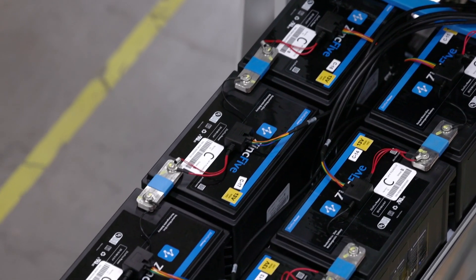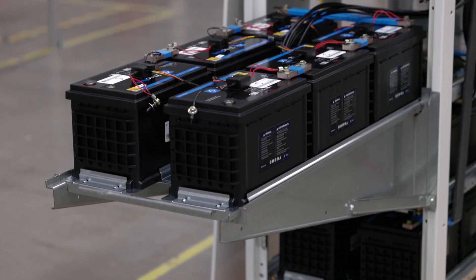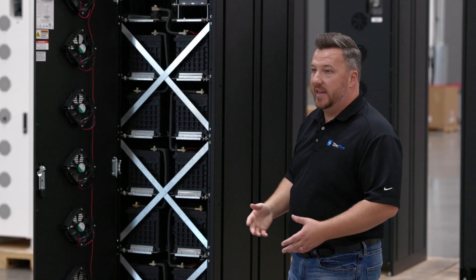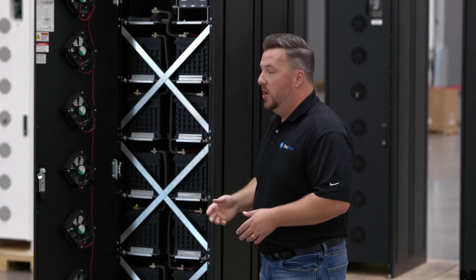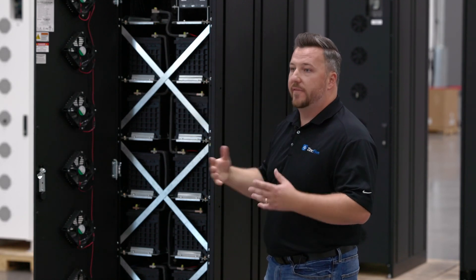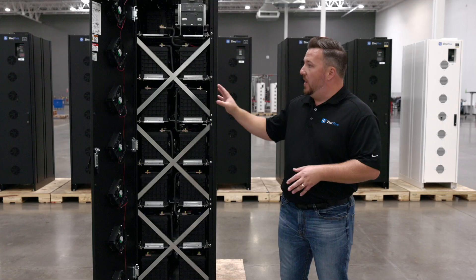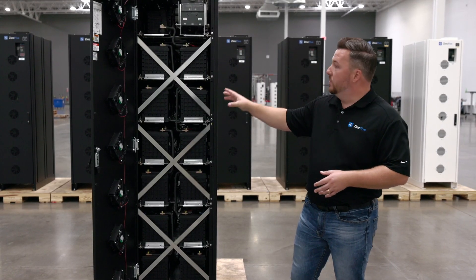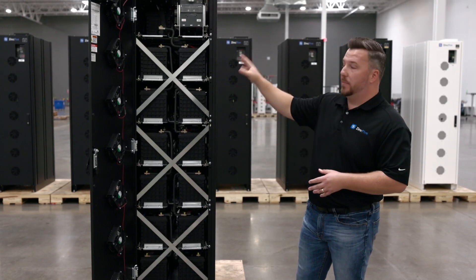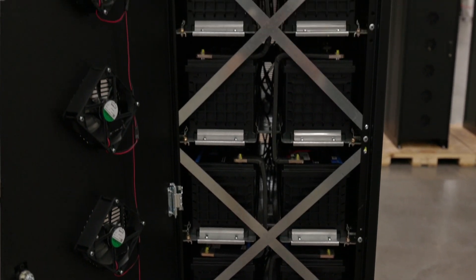For serviceability, we provide a tray support bracket that allows you to pull out our battery trays as one complete unit safely, to access the batteries or BMS as needed. Our BC Series products all come with the flexibility to include 37, 38, or 39 batteries and will be configured to your requirements. Our cabinet is extremely robust and seismic certified. We ship with X-Braces installed for transport and for high seismic zones — they can be removed if you're in a non-seismic area. We ship the product with batteries installed and BMS connected, which significantly reduces on-site install time.